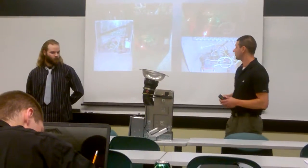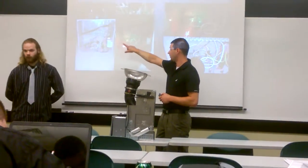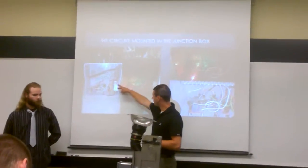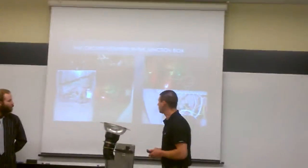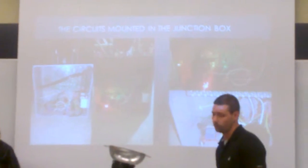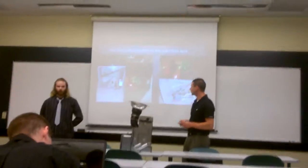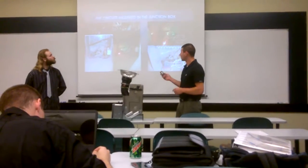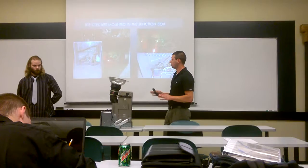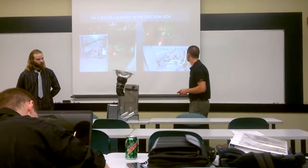This is actually inside our junction box, where we have everything mounted up. This right here is our converter that gives us a constant 24-volt power. From there we have it spliced off to two different voltage regulators — both 5-volt — going into our H-bridges. We have a relay in there to work our solenoid, because the solenoid was a big issue we had in blowing our H-bridges, so we changed it to use a relay. I spent 12 hours one day just redoing it — putting everything in there, trying to fasten things, getting the wrong parts, having to go back. But I'm pretty pleased with how the mounting came out.